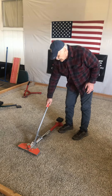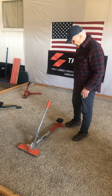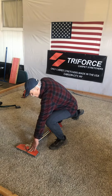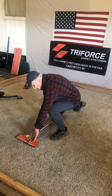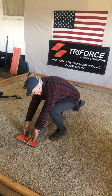I suggest you don't crank the handle — feel the carpet. I'm going to kneel down on this, put some pressure on the forward part with my hand, and then just press down on the handle. I'm not cranking the stretcher. The carpet's pulling right this way.